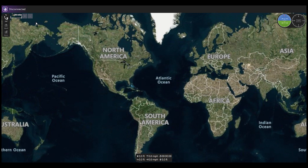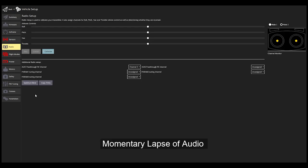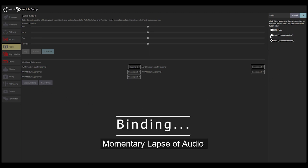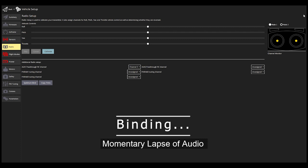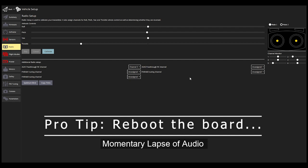First off, we'll be powering up the board with the XB radio. I have it plugged into the J5 port. Manual flight mode. Green lights on the radios, and you can see that QGroundControl connected. Check complete. Powering down the board now for the next component. Communication lost. Communication regained.